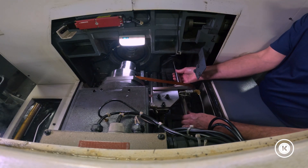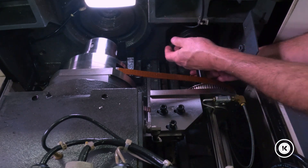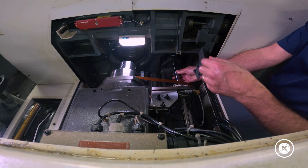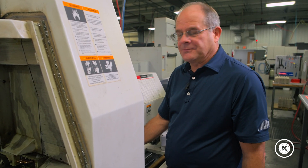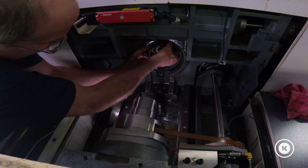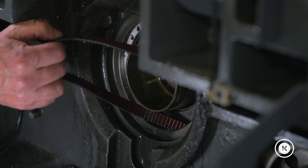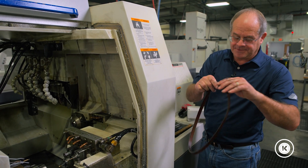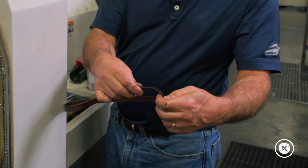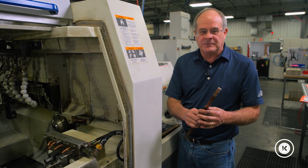So we can see that the drive apparatus — jack shaft — is loose. The belt's loose, which tells me that the guide bushing belt is loose. Now we're able to come in from the other side and remove the guide bushing and set our indicator up to sweep the housing that the guide bushing sits in. Last step on this side is we're going to remove the back portion of the guide bushing cover so we can see the belt and take the belt off the guide bushing pulley. I've removed the belt from the back of the pulley. It actually came right out, which is a good time to check and make sure none of the teeth are missing. We do have a couple of teeth on this particular belt that have marks on them, so I would recommend to the shop owner that he get some replacement belts and replace those.